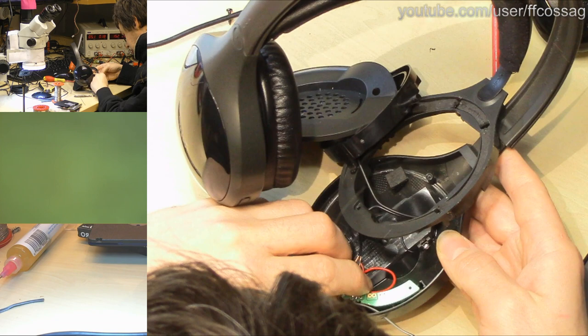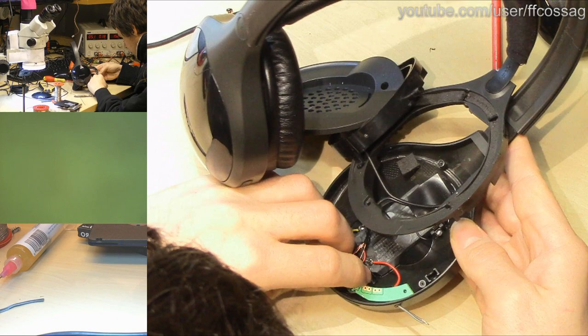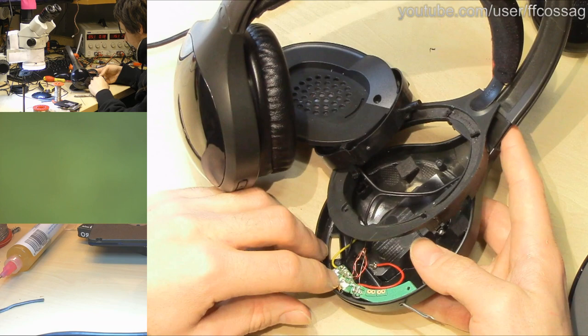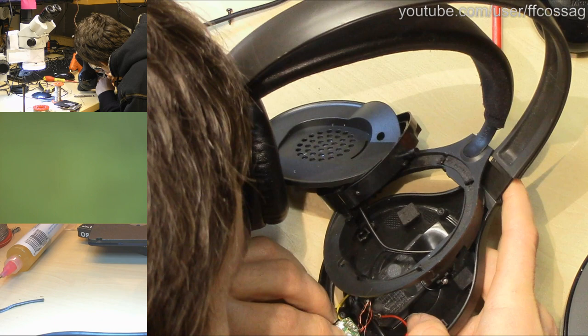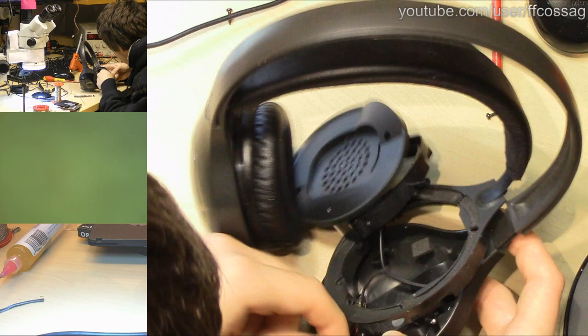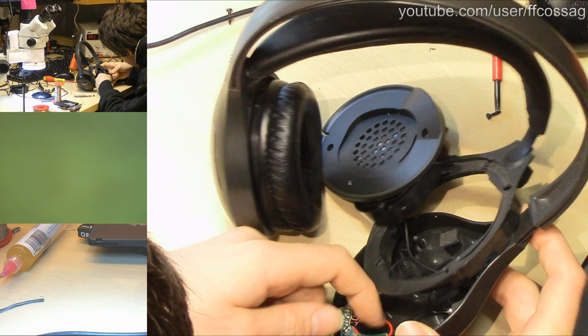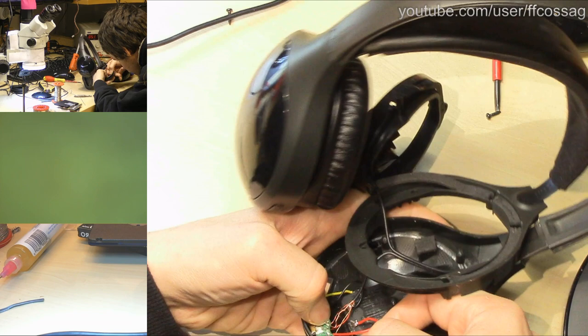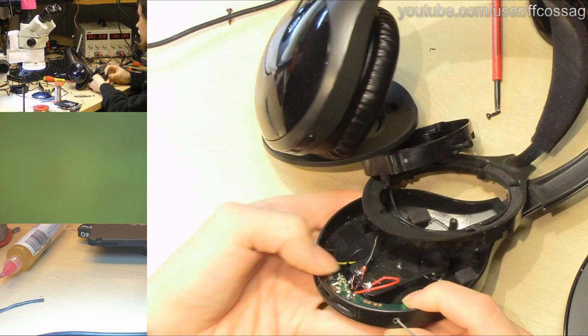Alright. Oh yeah, I cut it to reasonable length. Snap, crackle, pop. This board is not positively fixed down at all, which is not a very good design. That's pretty bad. Seriously, this just kind of bends in place. Now that can't be right. What's going wrong? Is my wire pinching against something? Oh yeah, it is pinching against something. That's why it's bending. There's a little plastic thing sticking up underneath there. So we need to route the wire around that and then we'll be good. Yeah, there we go. Okay, so the board mounts fine even with our wire on there.